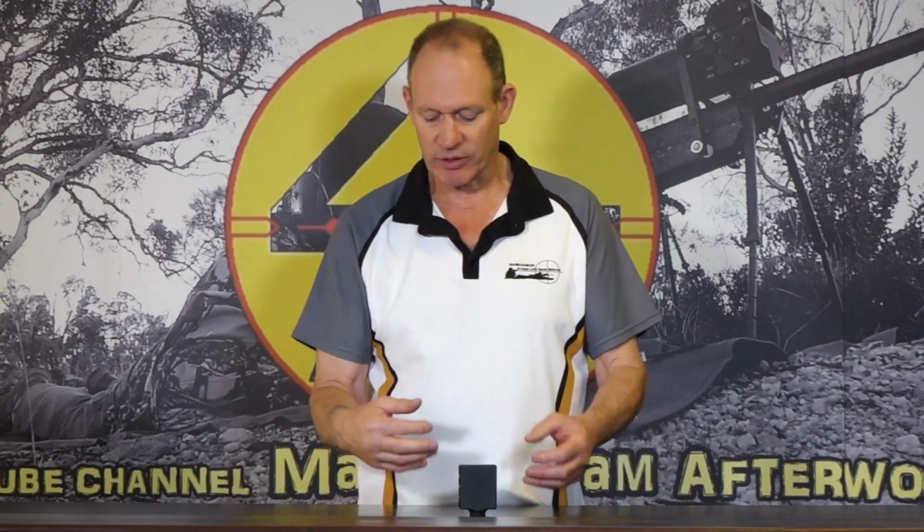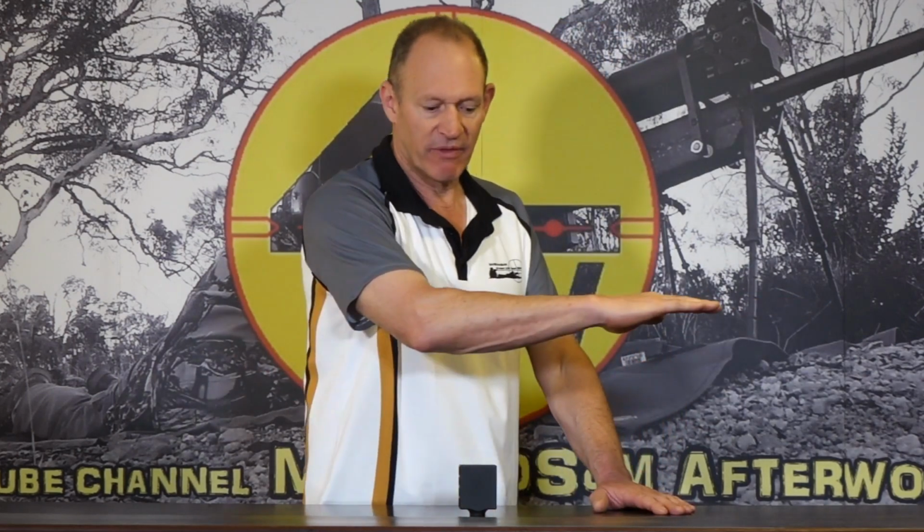The other thing that was very important to us was the way they affect a rifle. A lot of muzzle brakes have upwards ports, and the way they cut the angles of the ports and that sort of stuff can end up where they disturb the muzzle a little bit as it goes out. Now, that obviously happens largely after the projectile is gone, but it also happens just before the projectile. There is gas in front there that starts the rifle moving. So I wanted a muzzle brake that did as little to affect the geometry or the physics of the barrel, going straight back and not doing anything else.